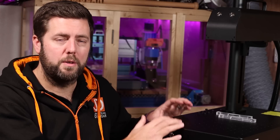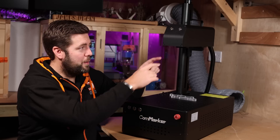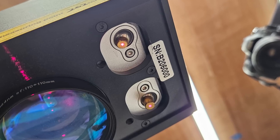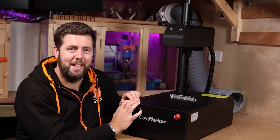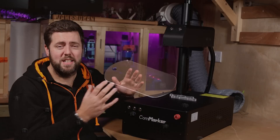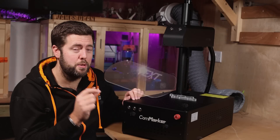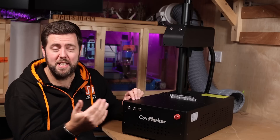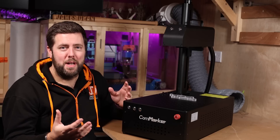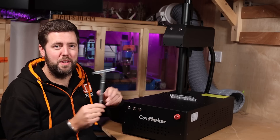By default the machine comes set up for the 110 lens, and when I say default I'm mainly referring to the focal point. Underneath there are a couple of lasers that all join up into a point — when they reach that point the laser is in focus. There is a measurement written on the side of the laser to guide you, but do your own test. The simplest way is to run a simple job like a square and keep raising the laser up and down — the light will get brighter or dimmer, and the best focal point is when the light is at its brightest and noisiest. Once you've found that, you can make a little jig to set the correct focal length whenever you're setting up a job.